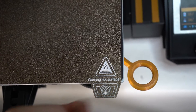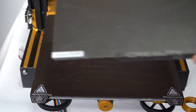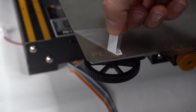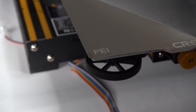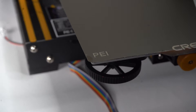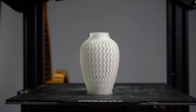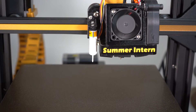PEI sheets will cool down after printing and self-release your part from the bed. They're also flexible, so you can bend the bed to remove the part that way. It also allows you multiple options of bed surfaces — smooth or textured. Specifically with the Ender 3, you can finally use the full bed size because you don't need those clips anymore to hold the stock glass bed in place. I'm partial to the textured plates because they seem to be a little less finicky for me. I pretty much use textured plates exclusively across my printers — slapped some glue stick in there — and I found that I'm good for everything from PLA to TPU and nylon. Your use cases and results will certainly vary.